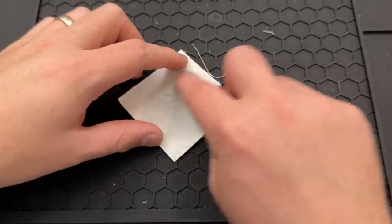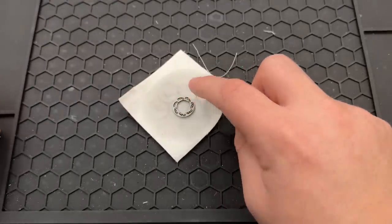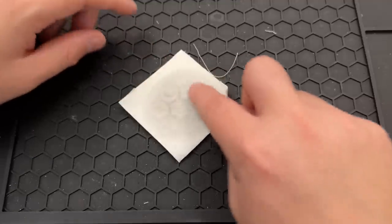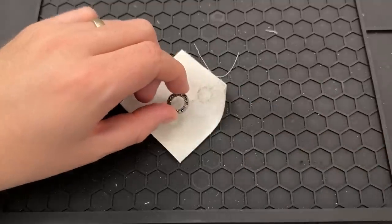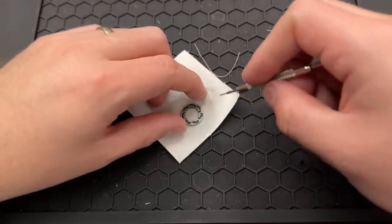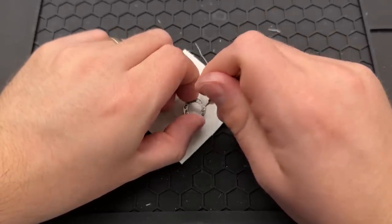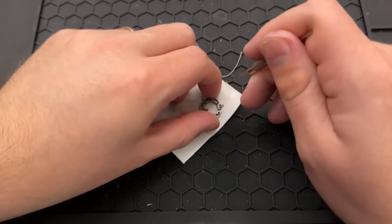The reason we are entering the danger zone is that as we remove the gunk from these bearings, they are going to want to come loose, because I suspect the thing that was holding them into this container at all was actually the oil, right? And so in order to clean this off, I'm going to need to just remove these bearings. What I'm going to do is use this watch spring bar tool, and I'm just going to pop these guys out.